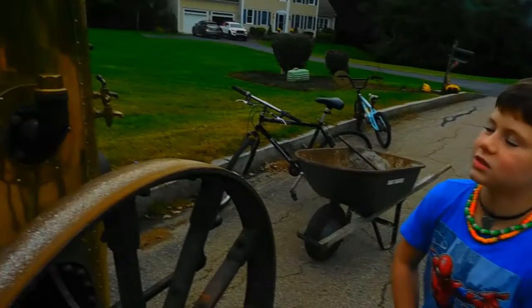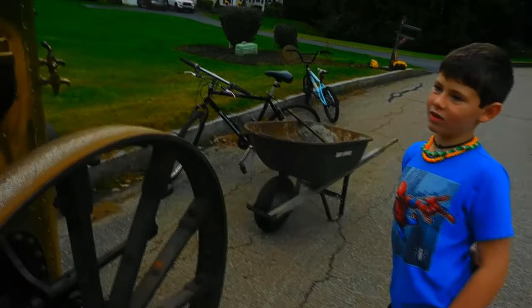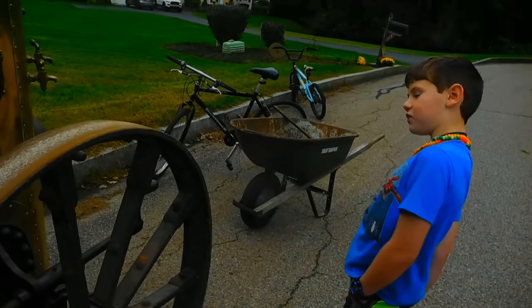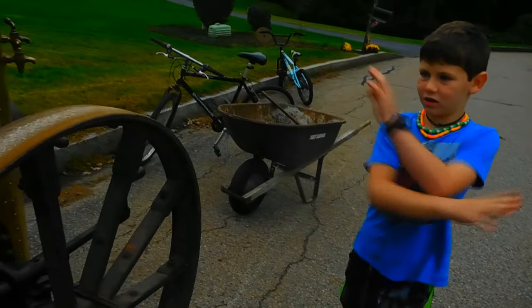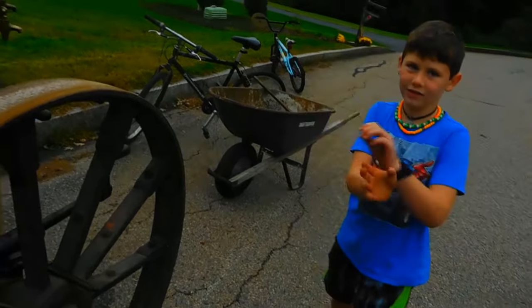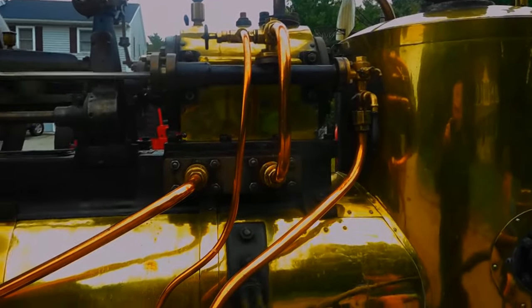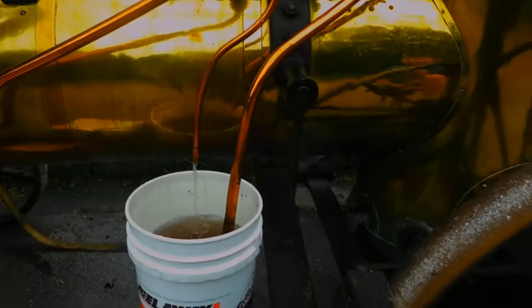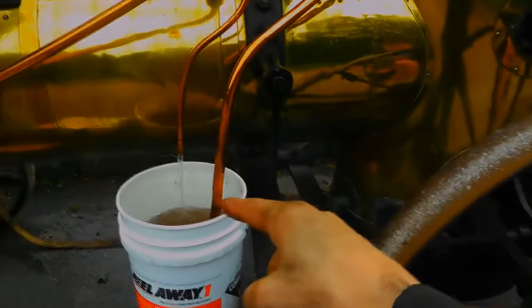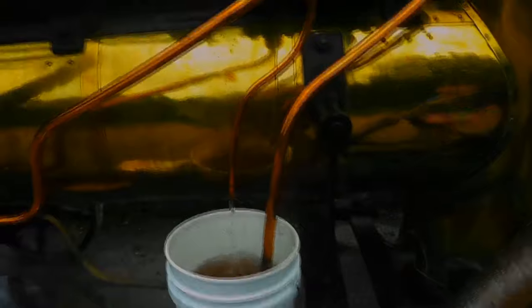There's so much — it's kind of like a game where you have a bunch of tubes and you have to connect them to a spot. It looks just like that. You have to untangle all the pipe. You gotta trace your systems. You always follow something to where it goes, figure out what that thing is, then go to the next thing and figure it out until you've got your whole system diagram in your head and you draw it.